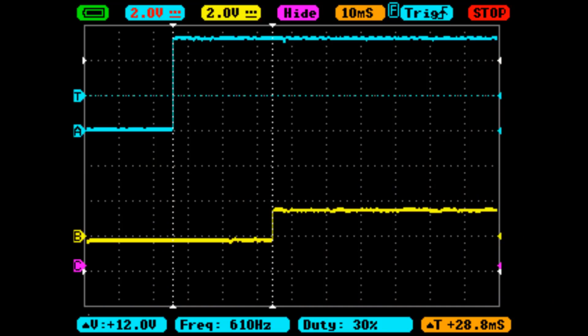There is some latency, and that might be cause for concern. Any system has latency, but this one in particular because I'm processing everything using a microprocessor. Using my DS-212 pocket oscilloscope, I probed the LED output — I flash the LED whenever a button is pressed on the controller, and then flash it again whenever it's received on the receiver. I probed each of those LED pins, and here you can see the top trace is the transmitter and the bottom is the receiver.